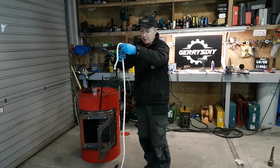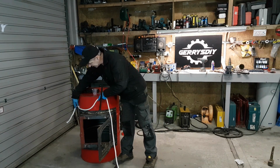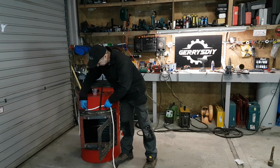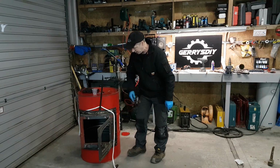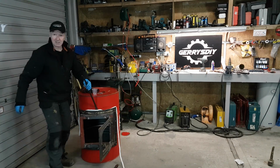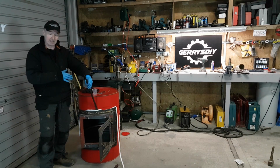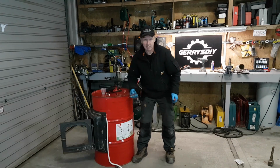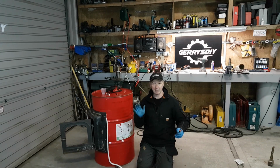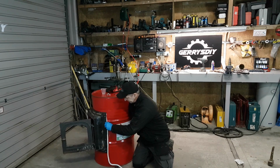This stuff is about 20 mil, 3/4 of an inch, something like that thick. So what I'll do is I'll lay it like that, and I'll put the joint on the side or down near the bottom. And you can see now, look, I'm just pushing it in on top of the bolts. I'll move this bar now in a second, but we'll get round it now. That's it. I have a nice tight fit, so I just have to go around, spring it, drop this in, and that's it. And all I'm looking to do when I tighten these bolts is that it pulls the front in on the barrel, and that the fiberglass rope gets squashed in that space, and that gives us our airtight seal.